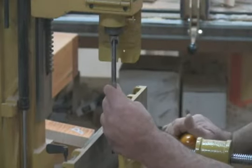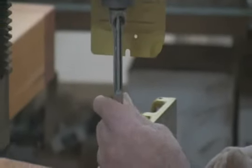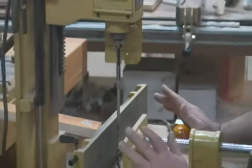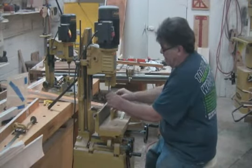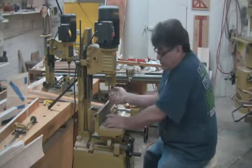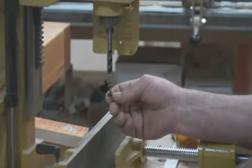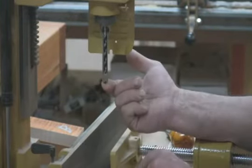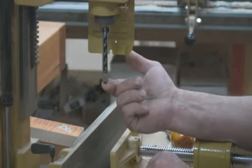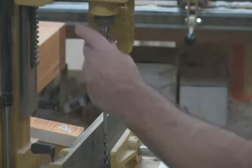There's the chisel. I always like the exit port on the chisel in front. Now, the problem most people run into is setting up. If you run your chisel all the way up into the bit, you're going to have an issue. The chips can't get past the seal that the drill bit is causing inside of the chisel. So the drill bit actually has to set down a little bit to give it clearance to pull the chips up. Here's a neat way of doing it.